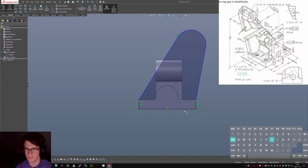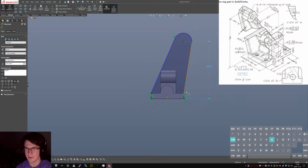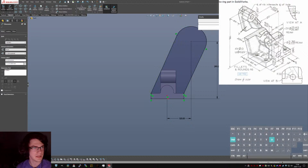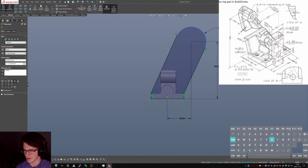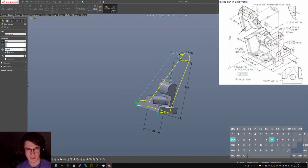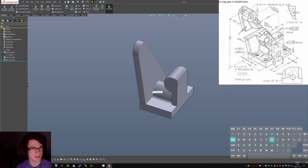And this center point is 295 up. And the drawing does not make it clear at all, but this is 120 off to the right. For that, I find this drawing exceptionally dumb. Say it's 32 OD? No, it's 57. So I'm going to do a quick 57 div 2 there, and then make it display as diameter, because otherwise it will drive me insane. So now we can exit sketch there, and reverse, make that 22 millimeters thick. So that's most of the geometry, actually.